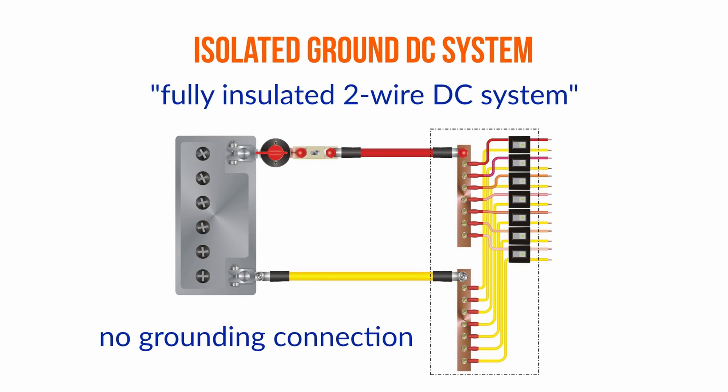So what would be your suggestion? Well, if they want to maintain the isolation and if it really is isolated, they're going to need to disconnect the lightning system from the DC system. But it may be better to just review all the electrical systems on the boat and see whether that's a requirement and whether that's the best way to do it. We do have quite a lot of lessons and modules on grounding AC and DC systems in our advanced marine electrics course, so if you want to go into the details and make your own informed decision whether you want a grounded or floating system, check out our courses on marine electrics at BoatHowTo.